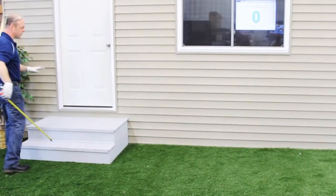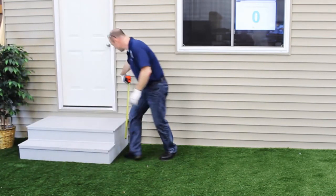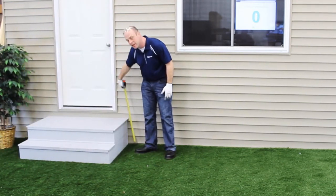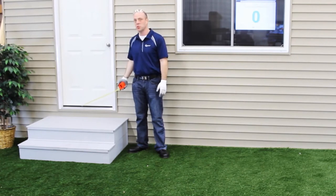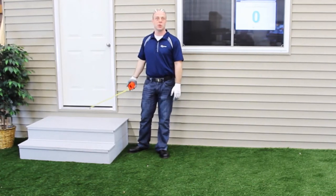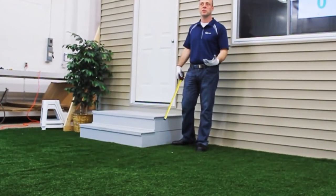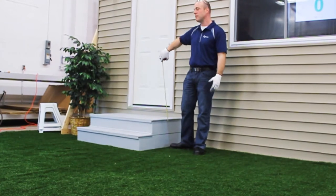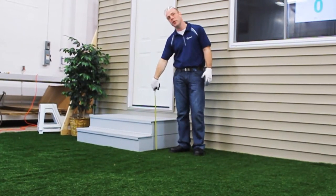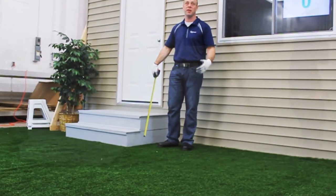The first thing I do is take a measurement from where we're going to put our platform. This is going to be 14 and a half inches high, and then another four and a half inches to get to the threshold — and the threshold is really what we're most concerned about. So we're looking at 19 inches in total rise, and I know already because of our sketch that we have nine and a half feet of ramp. That gives us a rough approximate slope of one to six. The one-to-six slope means that for every module down, you go down by eight inches, since all modules are four feet in length.